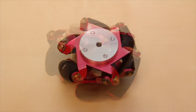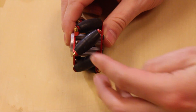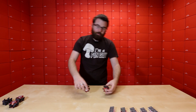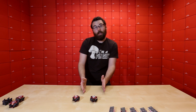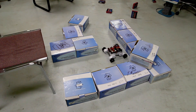Next we've got a new version of the mecanum wheels. If you're not familiar with mecanum wheels, we actually had an earlier version of these a little while ago. They're interesting in that they have these little rollers at a 45-degree angle to the main hub. The way they work is if you have two of these wheels and move them forward you move forward, move back you move back, but if you move them inside of each other they'll actually move out or in — so you can have a robot that not only moves forward and backward but can actually strafe side to side or even move diagonally in all directions.